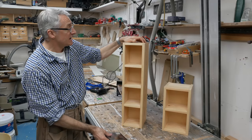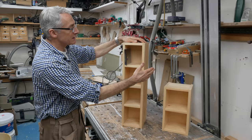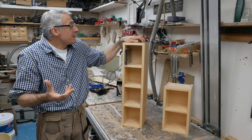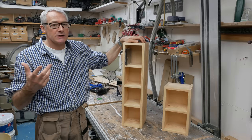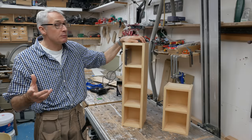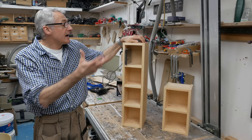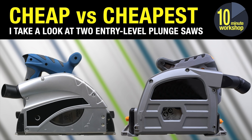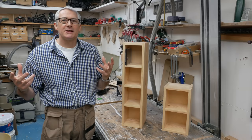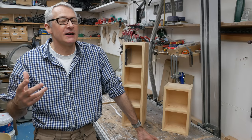These were made for CDs but to fill a space, so the spacing on the CD-sized shelves is a little bit off, and this one was made to match the other. But other than that, it's pretty simple and straightforward. As I mentioned at the top of the video, you could make these a variety of different ways — I made this a domino project because it suited me, but you could use dowels, biscuits, just glue the shelves in, or put a couple of nails in or even through dowels in a contrasting colour. In terms of tools, I used a sander and a track saw, but you can get perfectly good results from something much cheaper and simpler. That's this project completed.